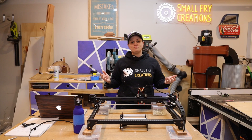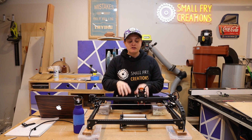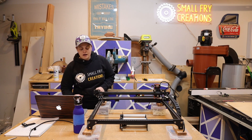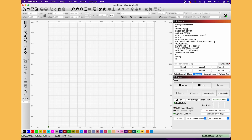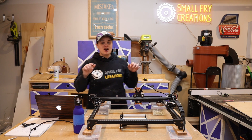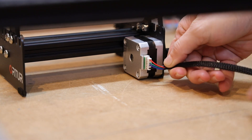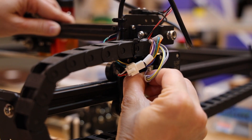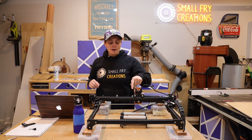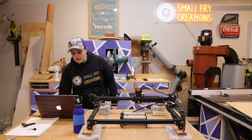It's been a long time coming and I'm excited. I should mention we also need to raise up the laser — I'm probably going to come up with a permanent solution but for now some screw boxes and wood will do the job. The first thing I need to do, without plugging the rotary in, is power on the laser as a standard laser so it auto-homes. At the same time I'll fire up LightBurn. I'm going to draw a random rectangle somewhere in the middle of my workpiece and under location send the laser out into the middle. Once that's done, I'll attach the rotary using the jumper cable — one end plugs into the rotary itself. Then I unplug the Y motor from the stepper motor and plug it into the jumper cable. That connects the roller. Now I need to set up the roller, so I'll go to Laser Tools, then Rotary Setup, and select that it is a roller.